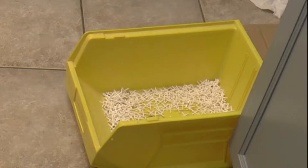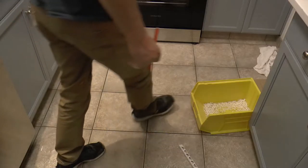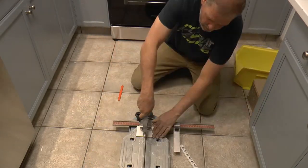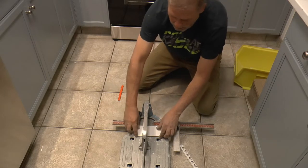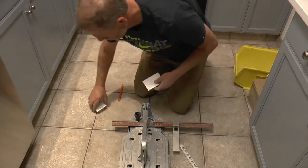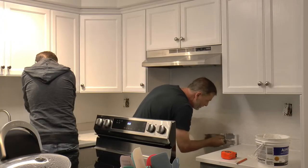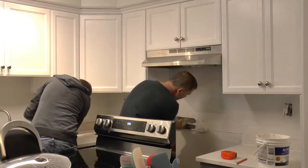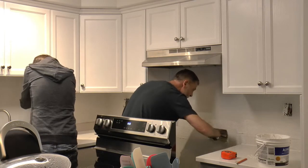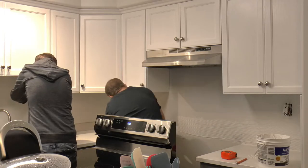Using spacers is a must in most cases. I'll be using 1/16-inch spacers simply because I think a smaller grout line gives more of a modern look — however, this is a personal preference. This tile is super easy to cut so I've only brought two cutting tools for this project: my 14-inch Sigma cutter and a grinder with a diamond blade, mainly for cutting around the plugs. I'll put links in the description below to all the tools I'm using. When spreading the adhesive, try and spread it evenly across your work area. The adhesive does start to dry fairly quickly, so don't apply it to a larger area than what you can actually tile, or you'll end up having to scrape off the dried adhesive and reapply it. You always want to set your tile into wet adhesive for full coverage and maximum bond.